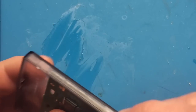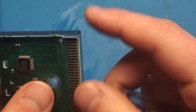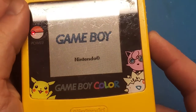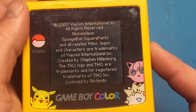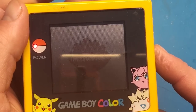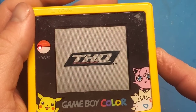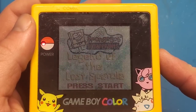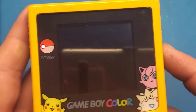Get some flux and get that. With Game Boy Color games, another thing to check is that the shell is not broken along the edges — there is actually a little sensor in there that makes sure the cartridge is the correct kind. Got a Nintendo logo — and we're booting into SpongeBob! Good point whoever commented that. Looks like just that one pin seems to have solved that problem, and here we are — SpongeBob!